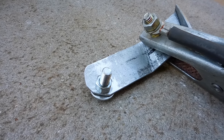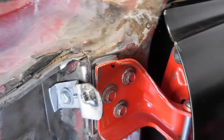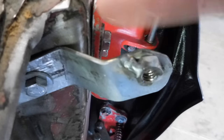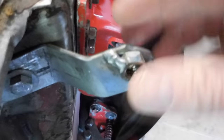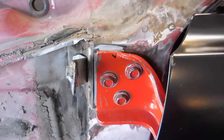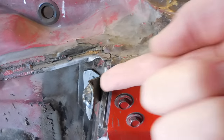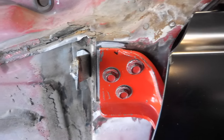I've been playing with this for a few minutes and one improvement I decided to make was to add a Z-shaped bend into the bracket. You can see it used to come out on a straight angle, but what I did was bend it out more forward and then put another kink into it and bent it back so the nut is now more parallel to the bracket in the fender. What that does is help when I try to install the bolt — it goes straight into the hole instead of on an angle. I'll give you a shot of what it looks like when the fender is installed but before I put the bolt in. You can see how nicely the hole in the bracket lines up with the flange on the fender. I'm glad I bent it like that.